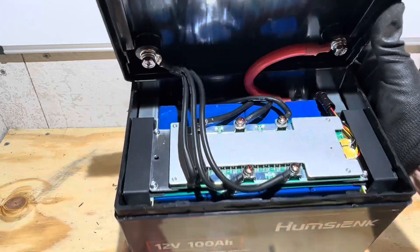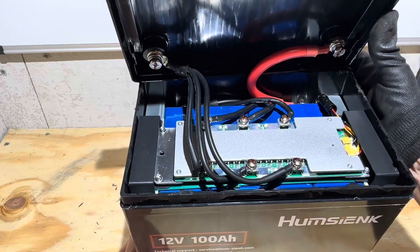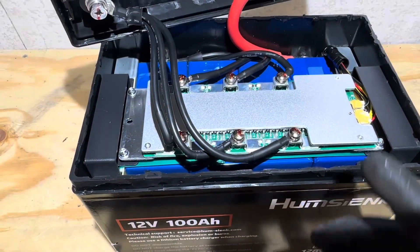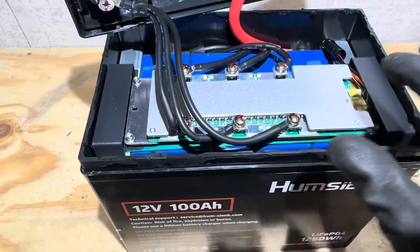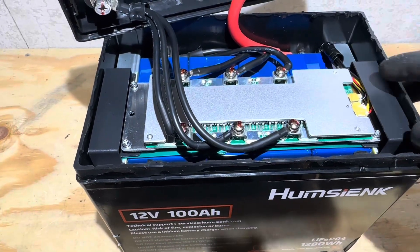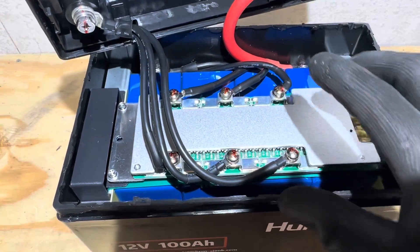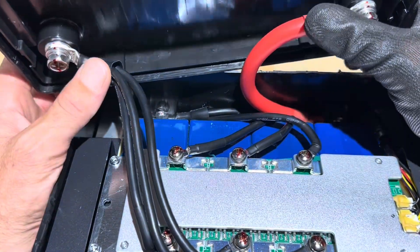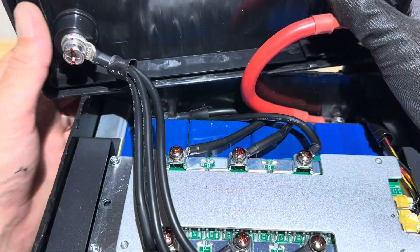That's looking good to start with — it looks robust. I see a metal case down the side of the cells in compression. No brand information on the BMS, but I'll check underneath it in a minute. It's got a nice metal casing down the side, similar to another battery I've worked with in the past. It's got a number four, 200-degree silicone jacketed positive, and three number tens hydraulically crimped on the negative side. Nice large wires on this one.